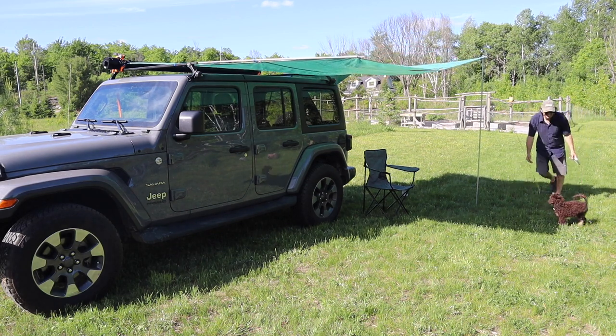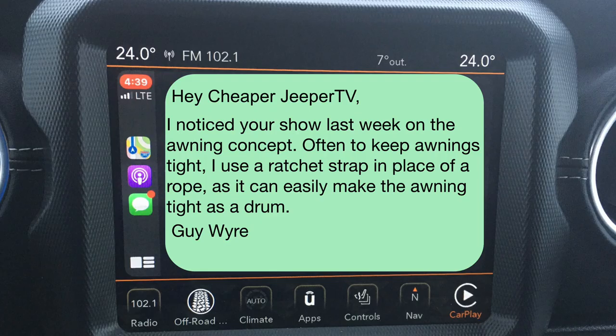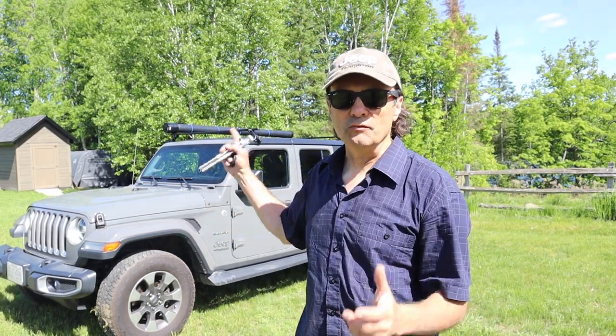Now for a subscriber tip. Hey CheaperJeeperTV, I noticed your show last week on the awning concept. Often to keep awnings tight, I use a ratchet strap in place of a rope as it can easily make the awning tight as a drum. Signed, Guy Weyer. Hey Guy, thanks for dropping us a line. Further to your tip: if you find that the wind is making your straps hum, just give them a twist and put a spiral pattern in the ratchet strap and that'll take care of it. You often see structures engineered for wind like that — tall towers — or have a look at your stock Jeep Wrangler antenna and you'll see the same thing.